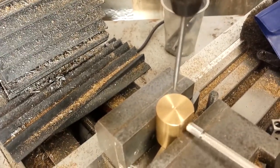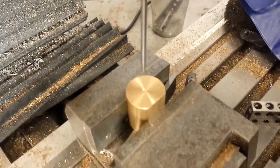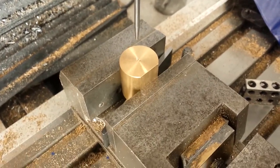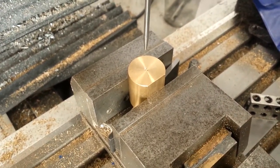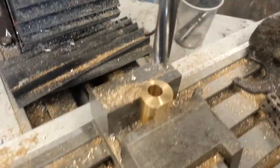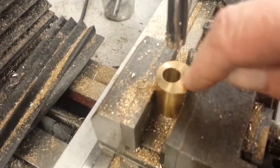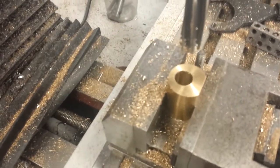Then I'll very carefully drill and tap this. I'm just going to get it set up and that'll be me for today — it's nice and sunny and I'm thirsty! The new cylinder has been drilled and reamed to 12 millimeters, and it seems there's quite a reasonable depth for the threaded pivot pin hole. Hopefully we're on the right track, but I have to be careful — once you slip past this, you have to start again.